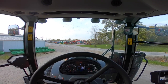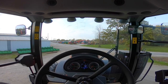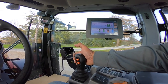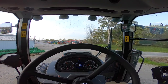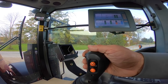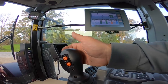It rained quite a bit last night and we're recording this on November 2nd, so I'm not going to take this tractor out to the field. Just push in on this button, throw it into gear and off we go — give it a little throttle. To upshift, hit the button; to downshift, hit the other button. We can also shift straight to reverse without using the clutch pedal — it will modulate on its own. The transmission controller manages everything automatically.